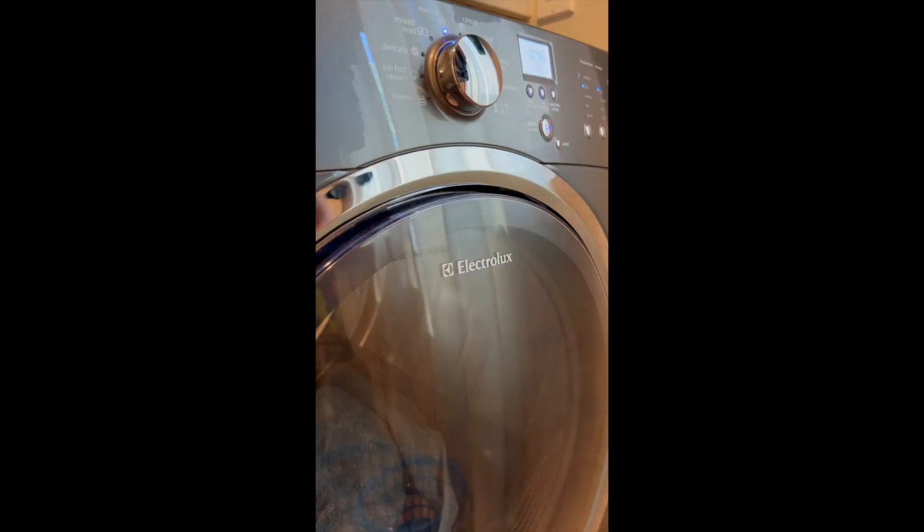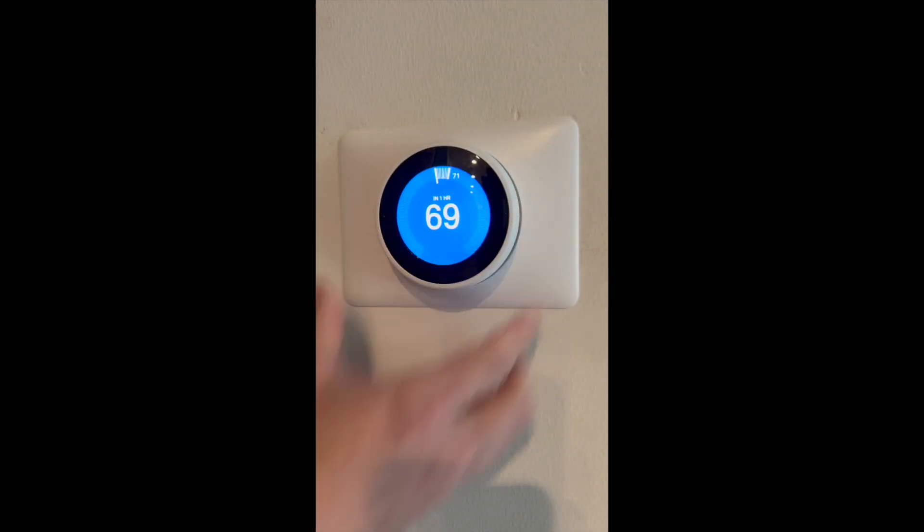So here's the test. Ever since I got this system I've wanted to see what the max output would be — hook everything up, plug everything in, and see what would happen. Before we get into the fun stuff, here are the basics: we have a 200 amp main panel and a 100 amp sub panel in the garage, which we use to charge our two EVs and run our laundry. For continuous loads, 80% of your house should be 160 amps max, which works out to about 38.4 kilowatts.